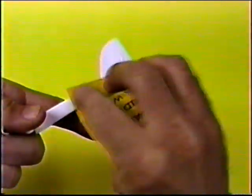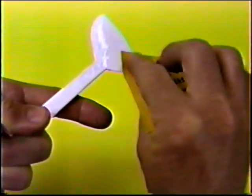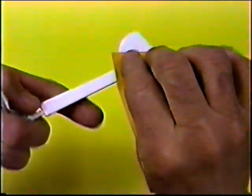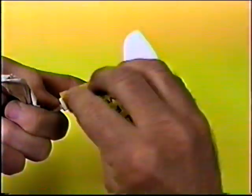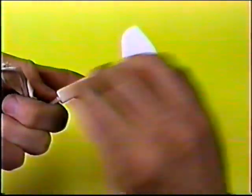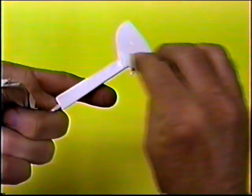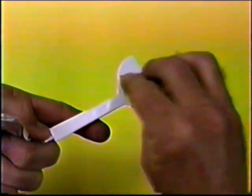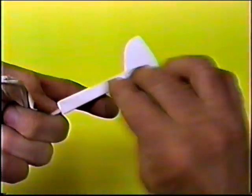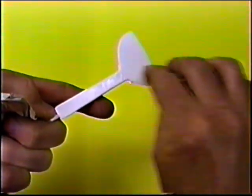Again, this is really just to get the dust out more than anything else, and there really isn't even a lot of dust in this. One thing we found out with the Brodak clear: when you're going to put the last coat on, if you put a little dose of retarder in there, even if you don't need the retarder, and you're willing to wait the extra day or two for it to harden up, you can really get a nice gloss that almost borders on being not necessary to buff out.